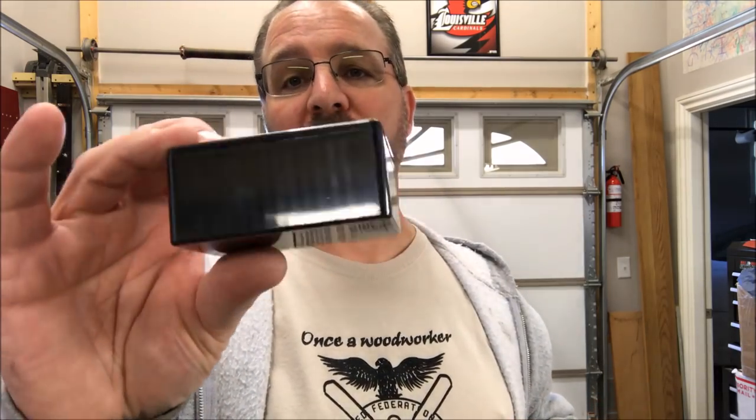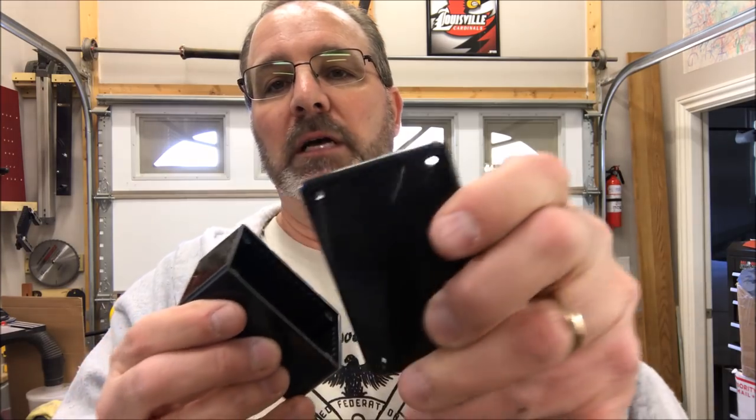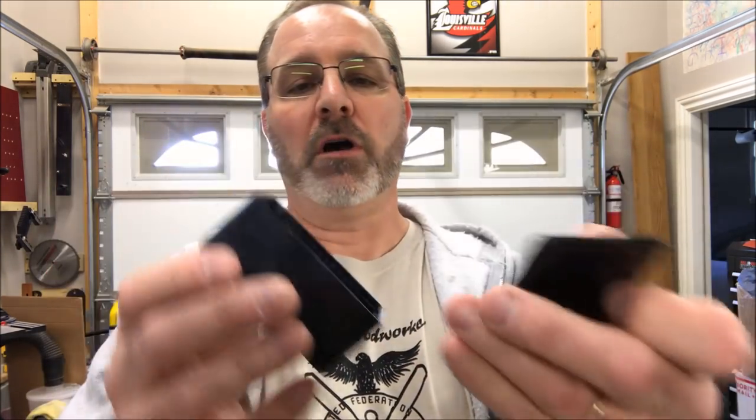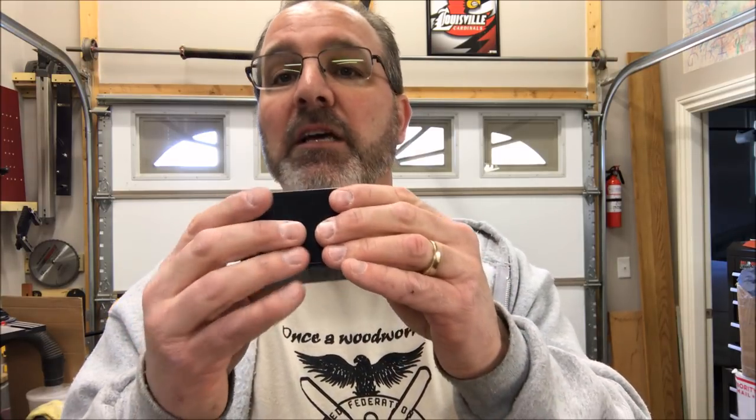The last thing I bought while I was at the electronics store was this little project box. And these are kind of neat. They're just little boxes. The lid will pop off and uses 4 screws to hold it on. And what I thought I would do is drill a couple of holes in the back for the inbound and outbound electrical cables to flow through. Drill a 1/2 inch hole in the front for the switch to be poking through. And I can attach this to maybe the side of my control box. And this will protect the connectors so that my hands or my tools do not come in contact with those components.